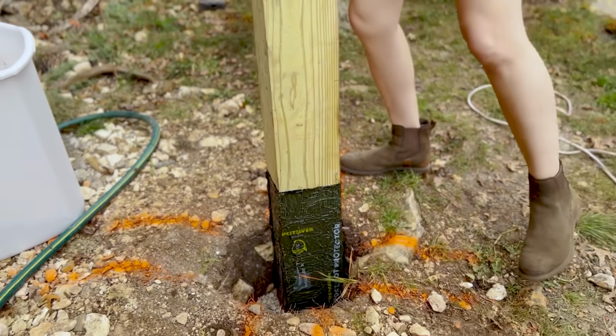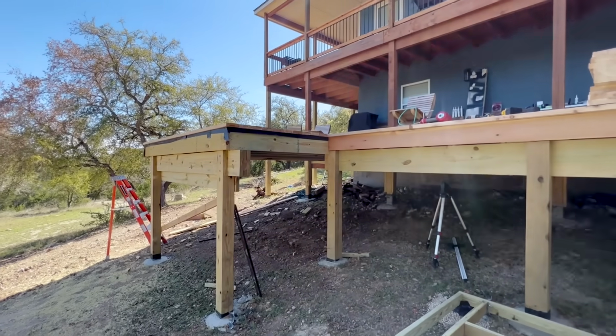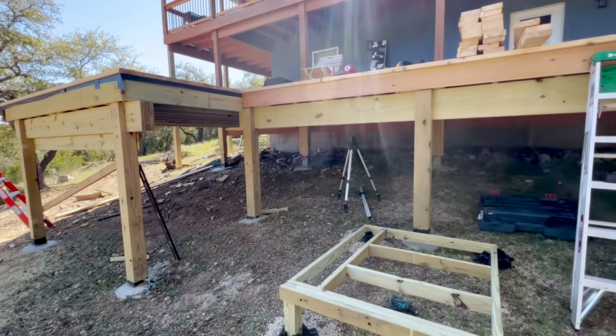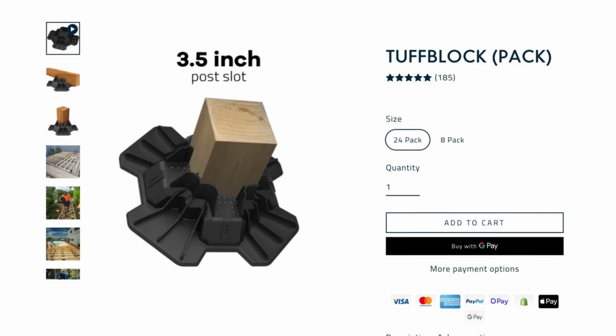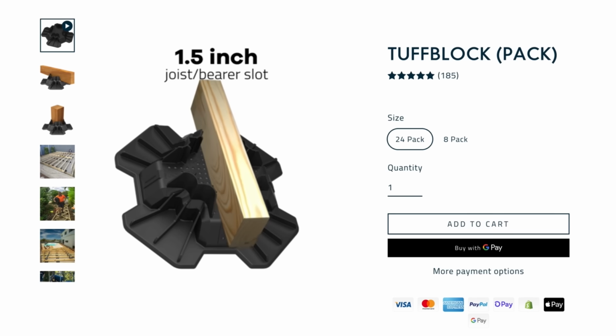Something the previous stairs completely ignored is a landing, which is the portion at the base after the last step, and by code it's required to extend past by at least 3 feet. These footing pads you see are called tuff blocks. Using them was so fast and easy, I didn't have to dig deep holes or carry and mix concrete. There's a link in the description.